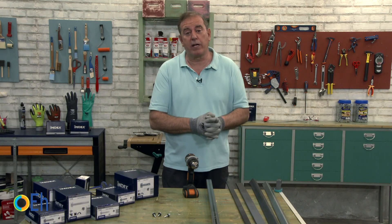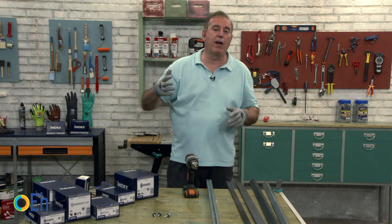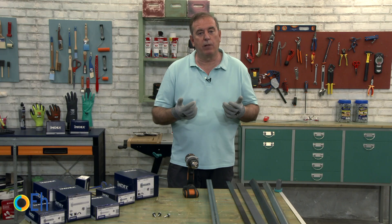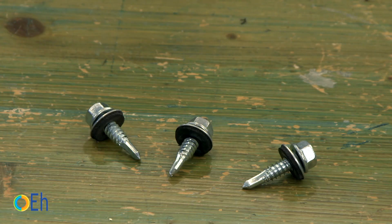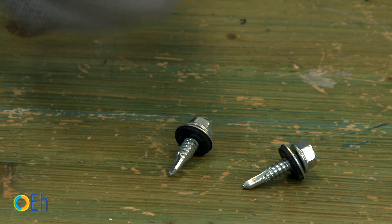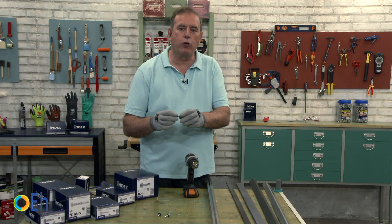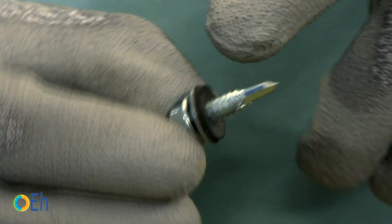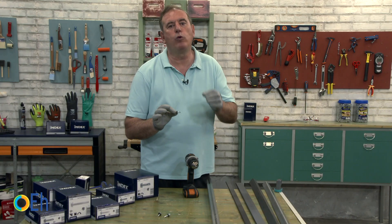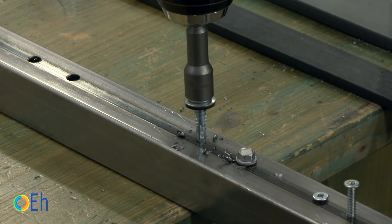Something important now that we are talking about outdoor placement. Another error is to directly place these screws on roofs or in places compromised by the presence of water without using any insulation when fixing them. Any screw I put in is a potential water inlet. Therefore, when we put this type of screws — whether galvanized, bi-metal, stainless, or any other type, with any kind of different head — we have this ring model with a neoprene protection that provides a perfect sealing gasket so that no water enters after installation.